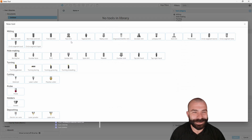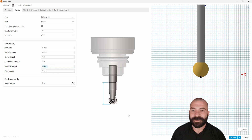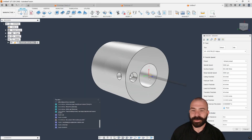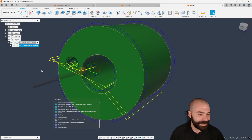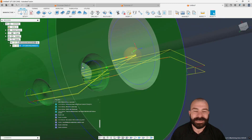Let's go ahead and get a tool here. We're going to create a lollipop cutter. I always like to be quite crazy with my dimensions on these at first — half inch diameter to a quarter inch overall length, let's bump that up to six inches, length below holder five. This is just going to make sure we can get inside that feature. We select that tool — there's my lovely lollipop cutter. I always love this OK button because if there is a problem the software will tell me. Simply by hitting OK right off the start, notice it is actually getting in there both outside and all of these inside areas on my part.